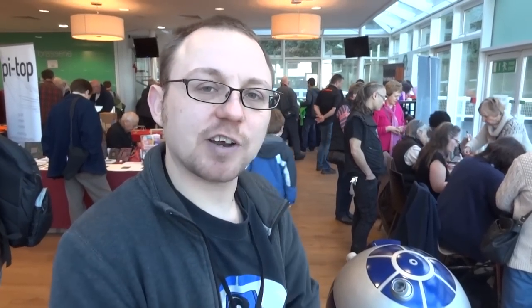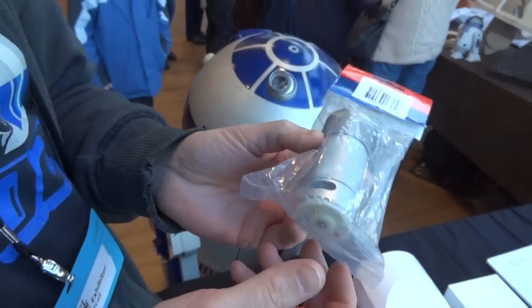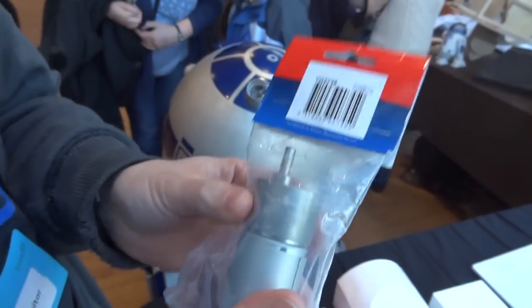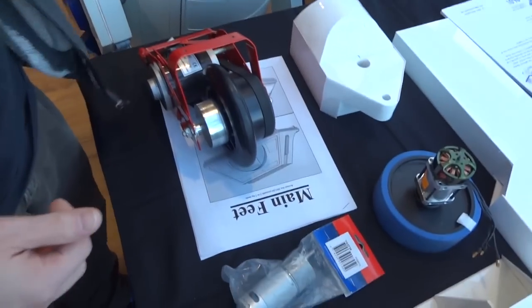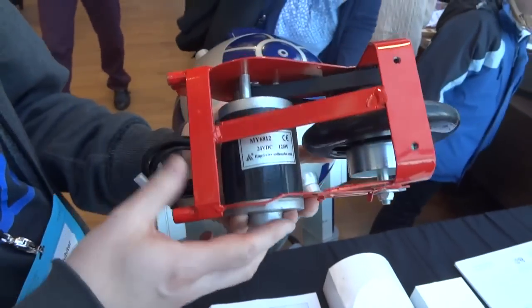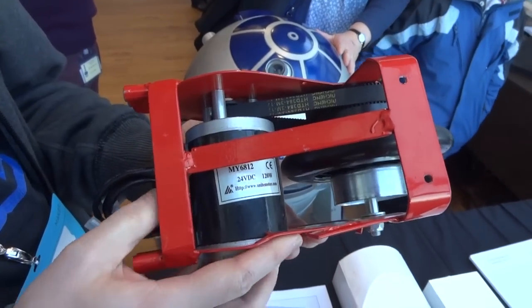Yes, so for my styrene droid, the preferred old method is the Jcar YG2738, which is a 160 RPM, 12-volt gear motor. There are a few problems with this — 6mm shaft, it's hard to get a set screw on it, and the gearbox does shear. So we've been looking at various options for a lightweight droid to replace this motor. On the table we have a standard scooter motor, which is a 120-watt, 12-volt scooter motor, used in some styrene droids, medium-weight wooden droids, and some lighter-weight aluminium droids. That's a fairly hefty chunk of metal — the motor alone is 3 kilos. It's fairly cheap though — about 16 pounds for the motor, with all the fittings probably an extra 20 pounds, so not too bad cost-wise.